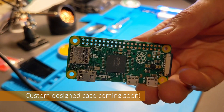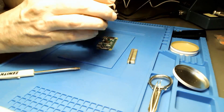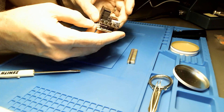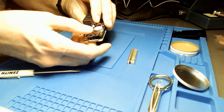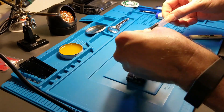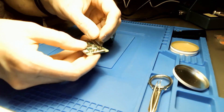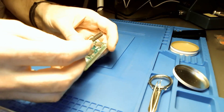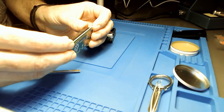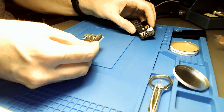This is an older Raspberry Pi Zero — not a Wi-Fi enabled version. Here are the header pins and the connector for them. You put the short end into the Raspberry Pi Zero making sure the long end is facing up, and make sure you put it on the correct side — getting that wrong will cause you no end of issues. Now that the header pins are lined up, it is time to solder.